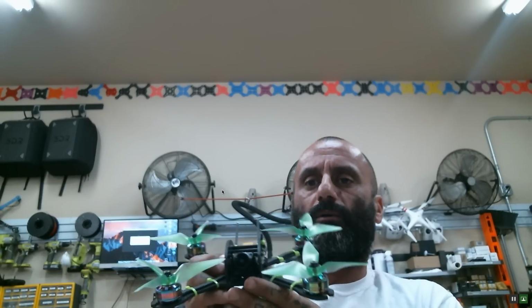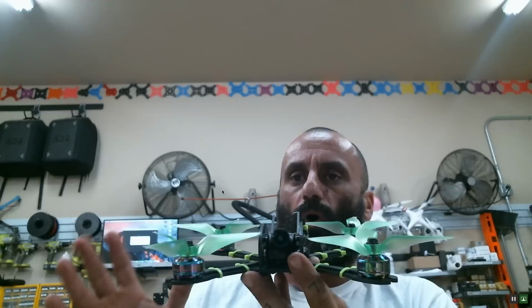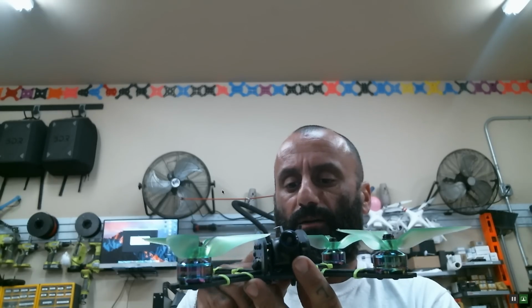The motors are putting out about 1,100 grams of thrust, which is almost 2.5 pounds. I mean, you have to be a little lenient on there. It's 450 some odd grams per pound, but I round a little bit here. So with a little bit of tweaking, you can get about 10 pounds of thrust on the quad, and you have about a 1 pound quad. It comes out, like I said, 1.03 pounds, and I can shed 0.03 by taking something simple off. So for argument's sake, we're going to say between 9-to-1 and 10-to-1 ratio.